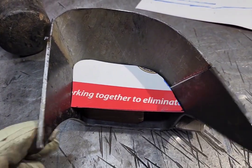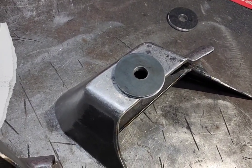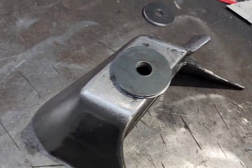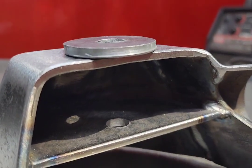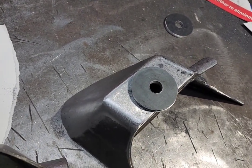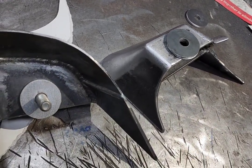Now I can cut this plate out and finish the passenger side. The last thing I'm going to do is weld on some washers on each side — 3/16ths washers on each side of the hole — just to make the bolt holes more secure. That'll make it over a quarter inch thick there for the bolt, so it'll just help hold the bolt and make it stronger and more durable. Then they'll be ready to tack on.